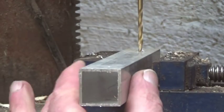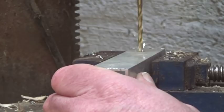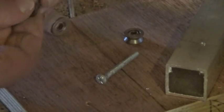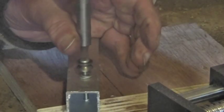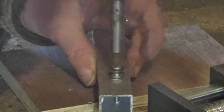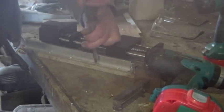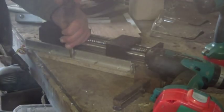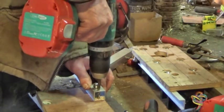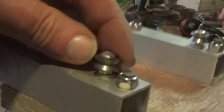Some aluminium tube and some V-bearings. I cut the aluminium on my woodworking saws but very slowly in case it chipped the teeth. Basically, I just made another bigger sled that rolled up and down over the original rails. I did take a bit of trouble to get the bearings in the right place, because they are not adjustable, but it wasn't very difficult. All it had to do is increase the triangulation so there's less wobble.